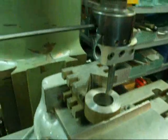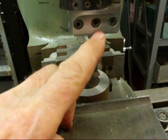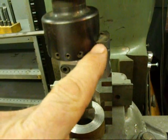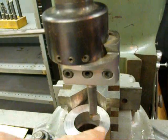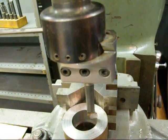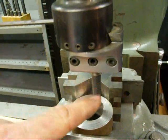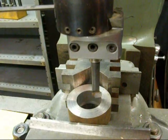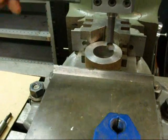I have installed a boring bar in the head and tightened it down. I had to use the middle position here, but this causes quite a bit of outreach, and there are times when I would run out of travel boring a hole and would have to reposition the boring bar into the next hole and start over — so don't feel bad if you have to do that. This little Allen wrench fits both the screws that tighten the boring bar and the adjustment screw.